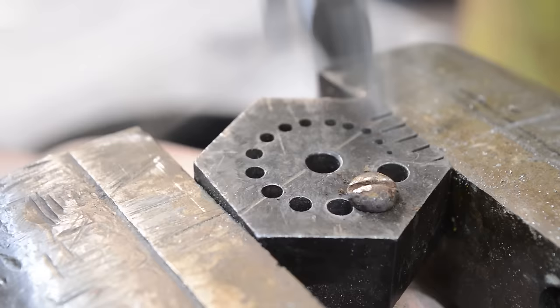A reassembly of this thing was really convoluted. It took Bruno and I about 2 hours of figuring out the order because unlike an older Winchester where you drive a screw out here, run the pin out, and pull the bolt out the back, the lock and blocks drop through, then you take the stock off, then you take the bottom metal out. Not on this particular one.